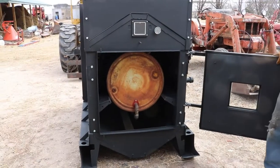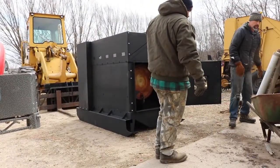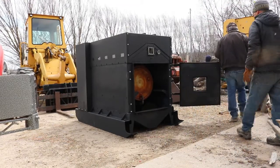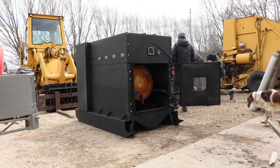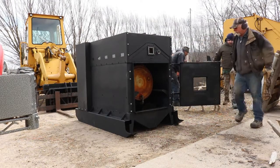It has two benefits. Right now it's still sitting outside. It will be leaving here and heading off to another farm for their evaluation — they're going to focus on the biochar portion and the heating portion for their high tunnels. It's dual purpose: it heats up the structure it would be within, ideally your greenhouse or high tunnel. Number two, it produces biochar. It uses a 55 gallon drum — you simply fill it up with wood, get the fire going, and 24 hours later it's cooled down and out comes your biochar.